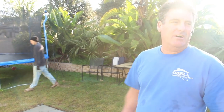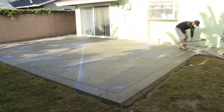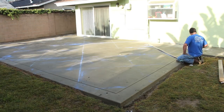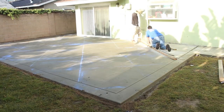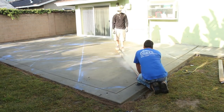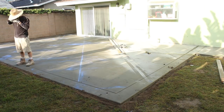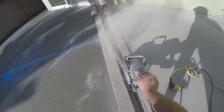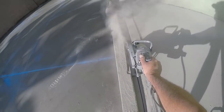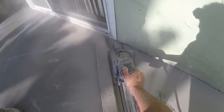We're going to start cutting now. I'm going to go to the GoPro for first-person action on the actual cutting. After you get all your chalk lines snapped, you're going to need a good straight edge to run your skill saw against with a diamond blade — that'll cut the concrete. You'll also need something to slide the skill saw on instead of just putting it on the fresh concrete, because that's going to scratch it up and make it look pretty bad for a while until it cures out.